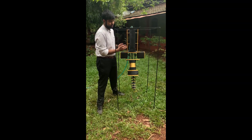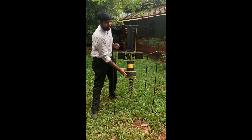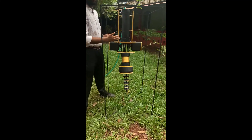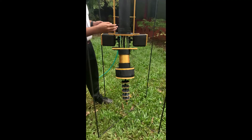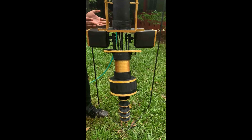The prototype has two components of motion. One is the intermediate link and the other the motor hub for the snake arm. The intermediate link has two motors placed in parallel but synchronized at hardware level. This has 180 degrees of rotation.